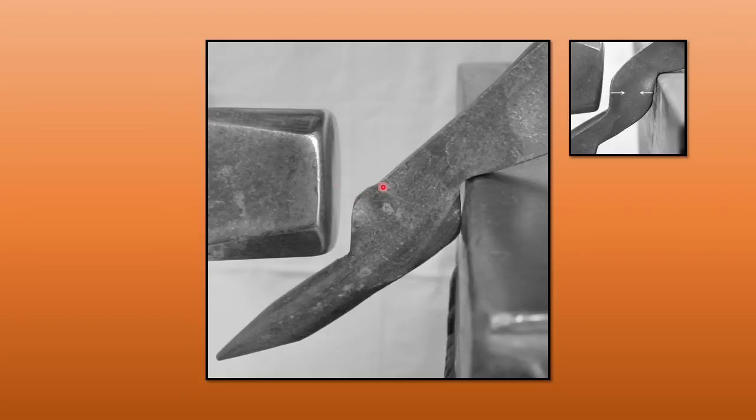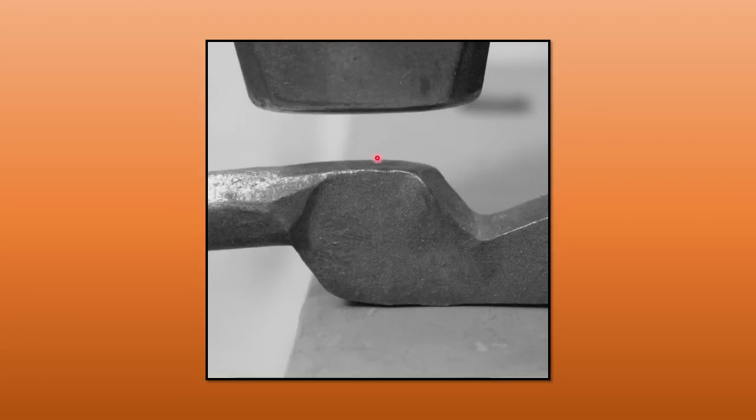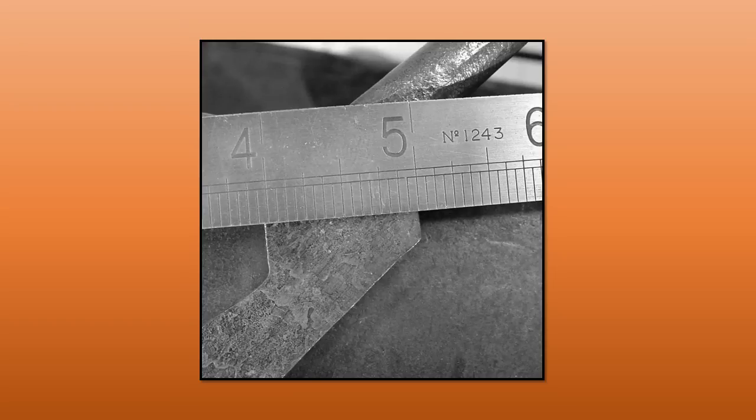Protecting the shoulder, put it in the right place over the edge you used before, then a couple of blows to flatten the boss. I'm looking for about an inch or 25mm between the flats — an inch in width and an inch top to bottom. The first jig upsets the material, the second jig puts that face on the anvil and comes in from the back, then drop it down, cycle the hammer to pull material into the corner, then protect the shoulder, hold it over the same edge, flatten the boss back to parent stock three-eighths of an inch, aiming for about one inch between flats.